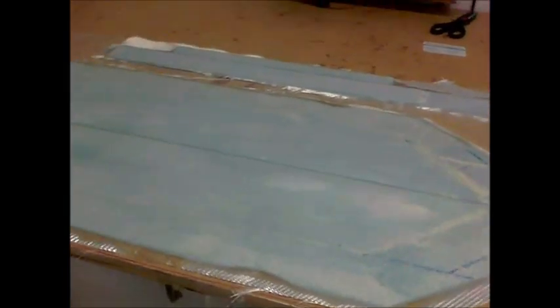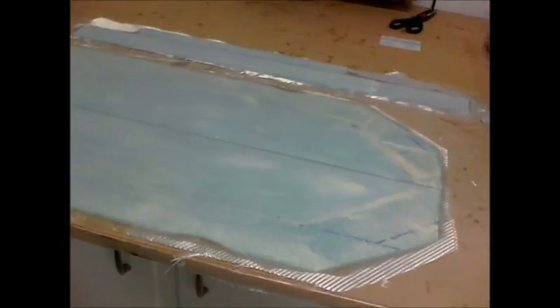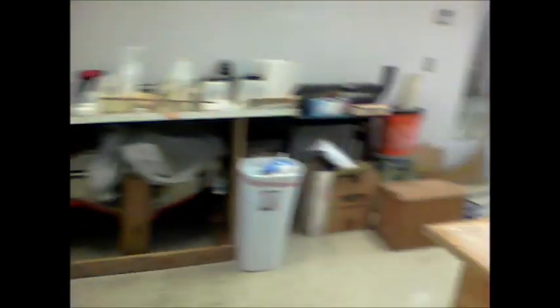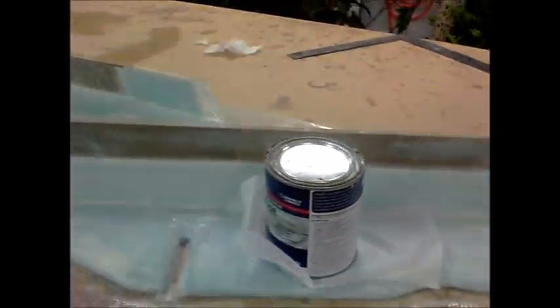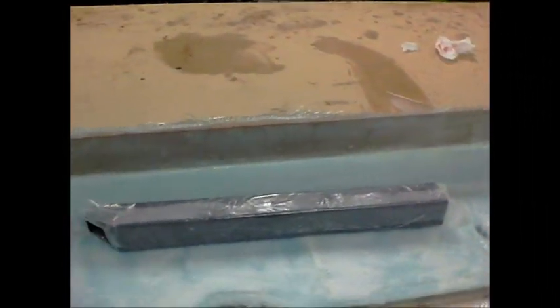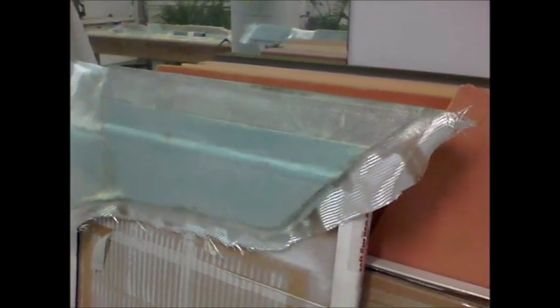This is a good example right here — this is the rear heat duct cover. I made mine a little bit taller than the plans; I was advised to do that because there's a lot of stuff that has to go through there. This is just one side, laying flat. This is the rear seat armrest — I've glassed the inside of it, both left and right sides, and I've also glassed the outside of the front armrest. This is two plies of bi-directional; the inside has one layer of bi-directional.